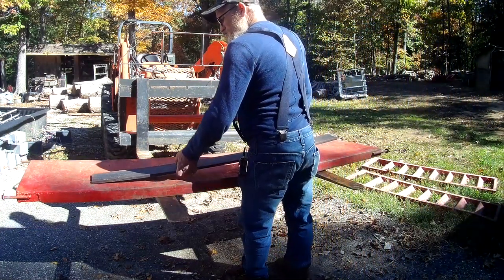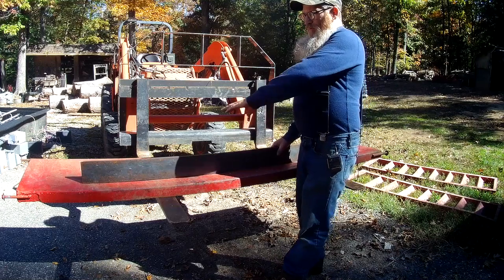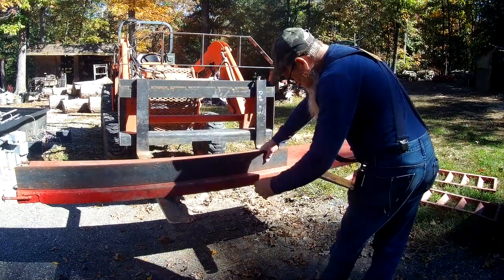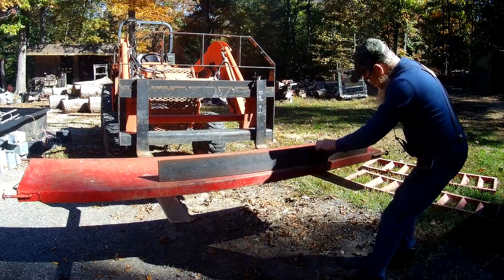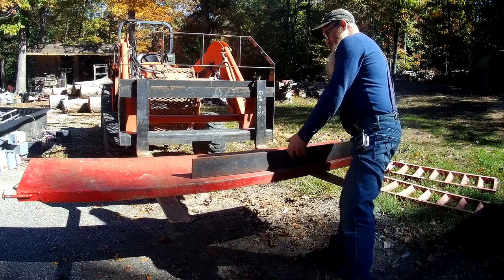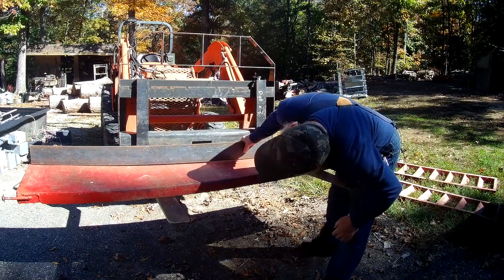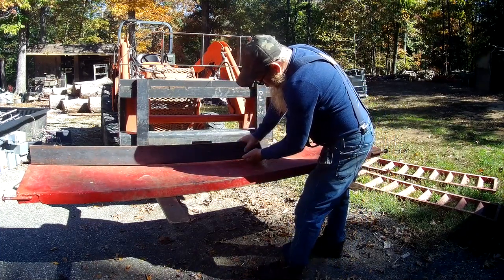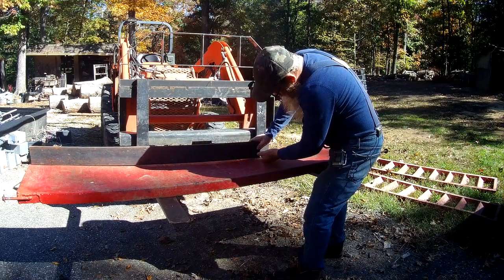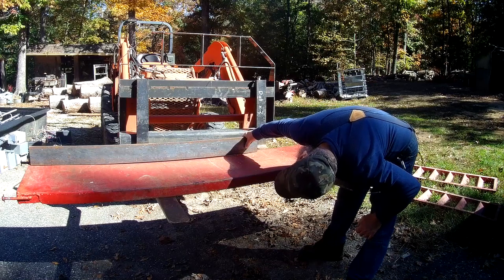we've got this piece of flat steel, half inch thick. And when we lay it across these edges, we start over here on this side, pretty flat, come all the way across, still pretty flat. Go up here to this corner. I'm pretty flat, but I've got some gap right here because right in here, this thing is swole out. Right in there, it's swole out.